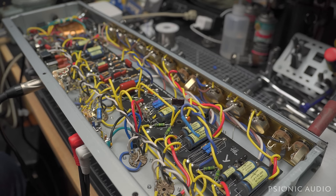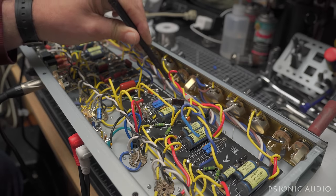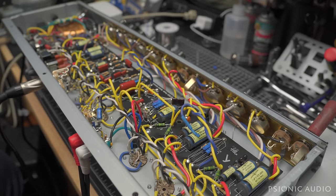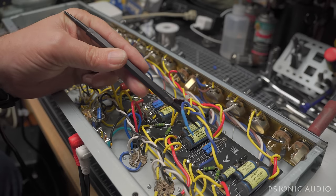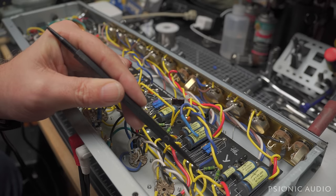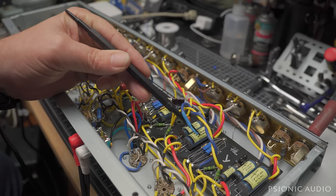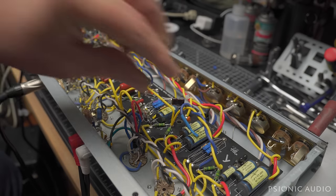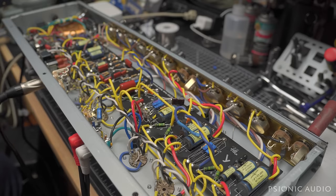What are the level 1 fixes? Level 2 and 3 would involve shortening wires, changing lead dress, removing excess — really getting things perfect — which would cost a lot of time. We're not going to do that if we don't have to. Level 1: the first thing I did, since the owner isn't using the normal channel, was disconnect this blue wire going from V1B's plate to V2B's plate. Since it does have voltage on it, I've put some blue heat shrink on it and taped it off, and it can easily be reconnected should the owner want to use this channel again.